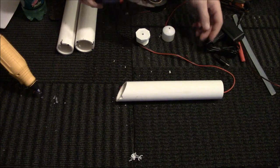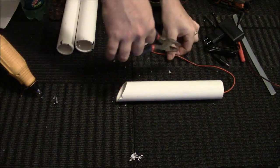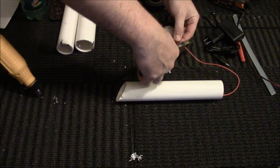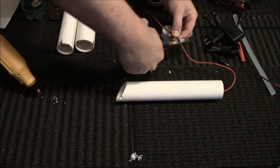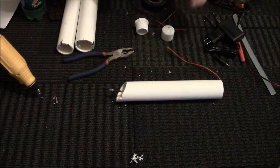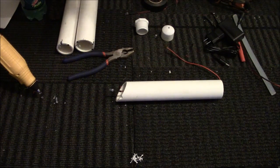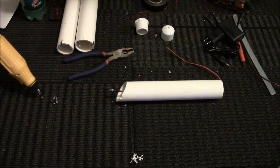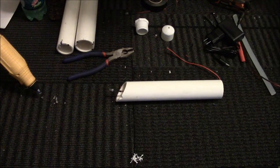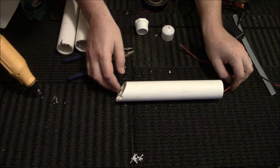So you can actually now cut the LED leads, and what I would do is I would definitely cut it much longer than you need. So now you have this nice lead right there. Still should have enough. Basically what I give my class for this is I give 6 feet of wire, 6 feet of speaker wire, and that should be enough to do plenty of it, plus add some to the end for your power supply. So we now have that one is done.